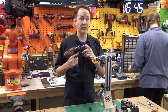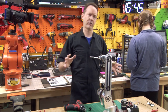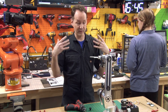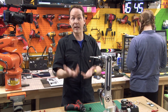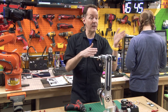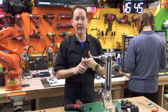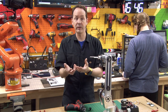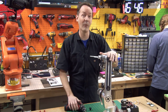The smaller the bit, the faster it spins. And a lot of people come out and say, well, there's really no hard and fast rules and numbers. Actually, there are. They publish whole tables of them for use in industry. And these are important. And they change, they evolve. Because the speeds and feeds that worked great 30 years ago still work if you're cutting that material with that thing. But we have machine tools now with carbide bits and a way higher quality of carbide than you could get 20, 30 years ago. And we have different materials. It's not just space age aluminum. We have internet age aluminum now, which is way better.